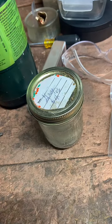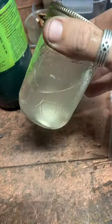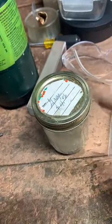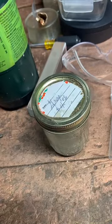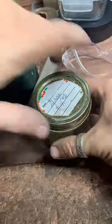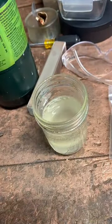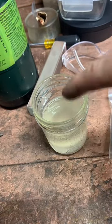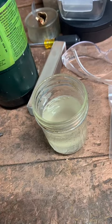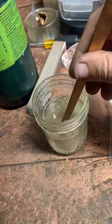Pickle's good. I had another ringmaker on me to get some pickle for like a year straight, and I was scared of it. And I finally broke down and got some and started using it, and now I love it. It's great. Saves me some elbow grease. But you have to use copper to get your stuff out. So I've got copper tongs. So if I put steel in here, it would spoil the solution.